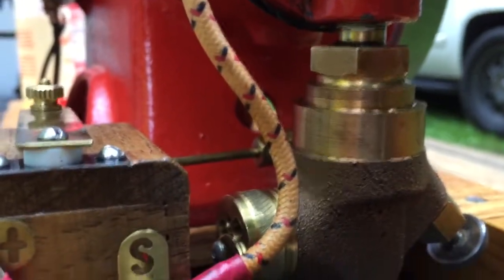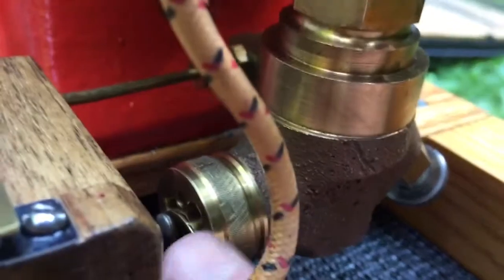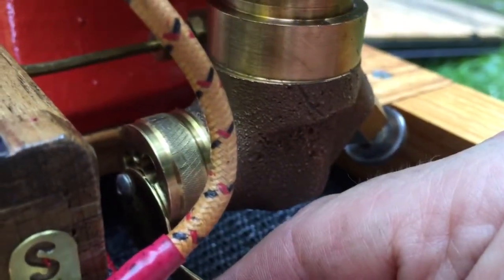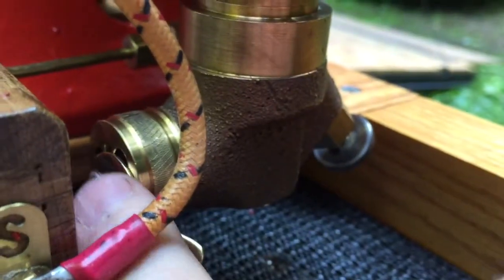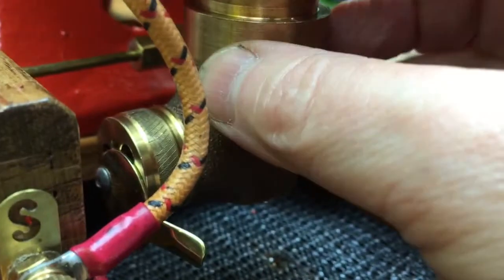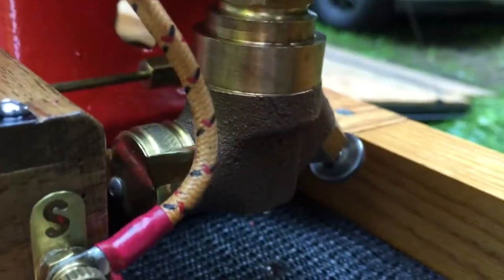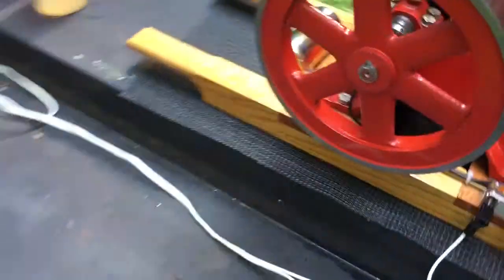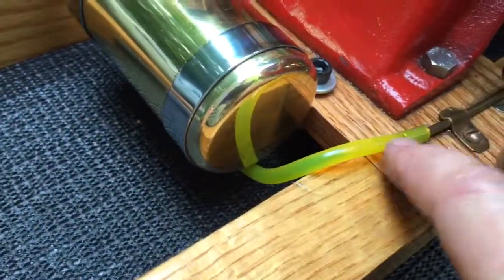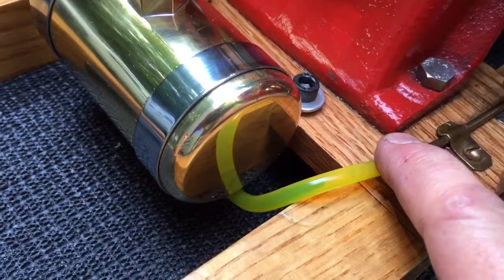On the fuel mixer — I like to call them carburetors, but I guess there's different terminology for hit-and-miss motors. This one originally did not have a choke plate on it, and I made this choke plate because they always seem to run best with a little bit of choke. You need a little bit of choke to suck the fuel out. When you first turn it over after filling with fuel, just spin it over once or twice and you'll see the fuel travel up in the fuel line. That's why I put in a clear piece of line — so you can see the fuel sucking up. If you turn it over any more than that with the choke on, you're going to flood it out.